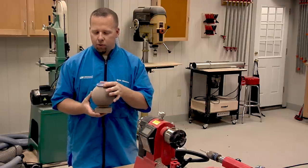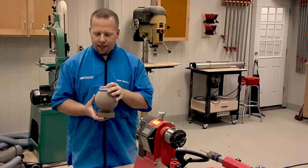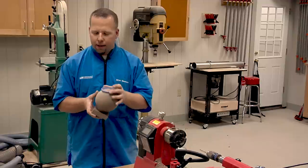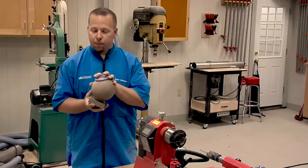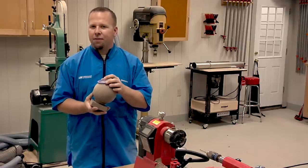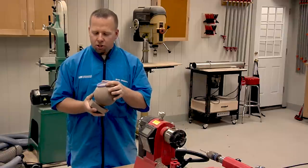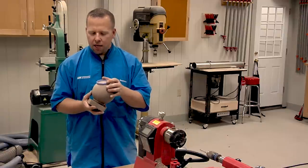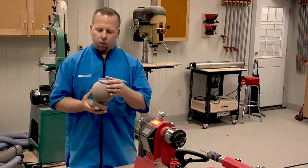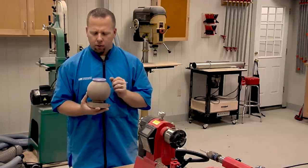This gives you a gauge to go by to determine if something is a perfect sphere. The diameter of this ring isn't critical. The smaller the ring is, the less area you have to work with on guessing. By making a smaller ring, I have less guesswork. Unfortunately, the smaller the ring is, the more difficult it is to perceive small variations when it becomes unspherical. So I usually start with a smaller ring, about an inch or so in diameter, maybe a little larger.